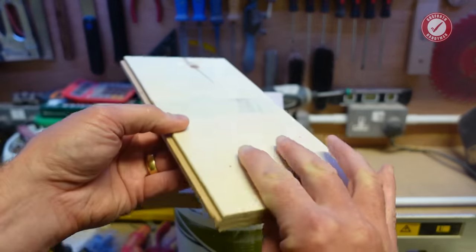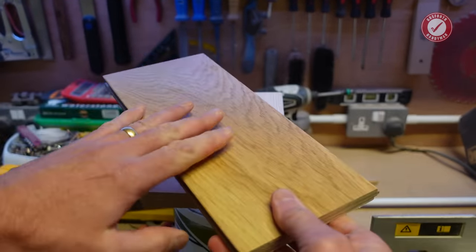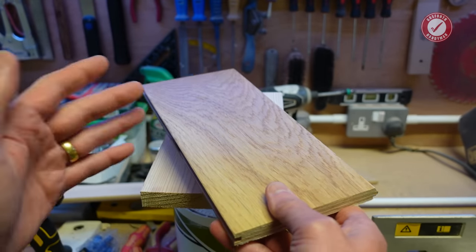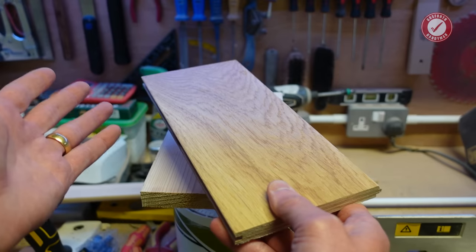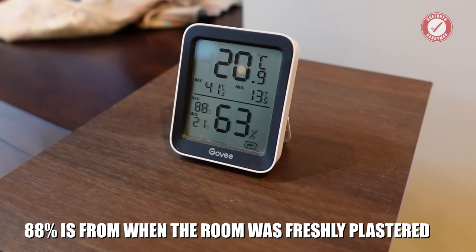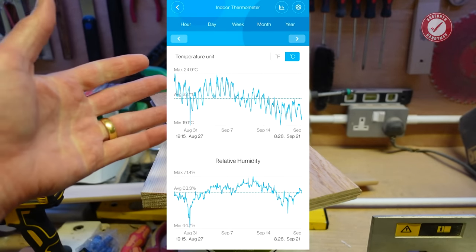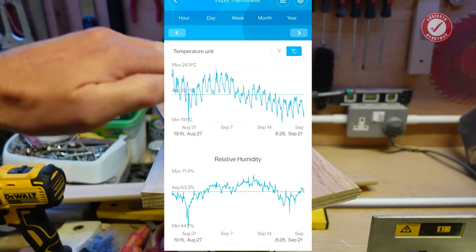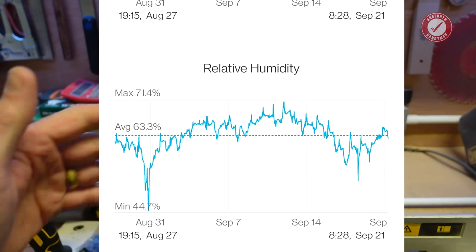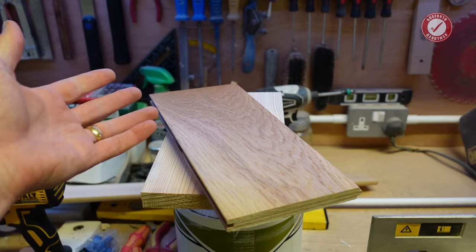For the situation that we've got here, I've been keeping a close eye on humidity and temperature. We installed the floor when it was around 55% relative humidity and we're always between about 40 and 60% anyway, keeping a close eye on that with a humidity monitor. When the central heating's on the house dries out quite a lot and when we've got the stove going that really drops the humidity. But it generally doesn't go anything below about 40%. And obviously I'm living in the property, so if it becomes a problem I can address it straight away, but I don't think it will. I will report back and let you know later down the line.